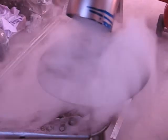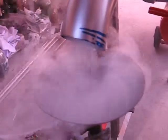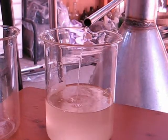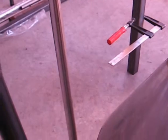Now I'll try to point out when the condensate starts to run. It's just here on that long flowing line. This is the pure essential oil flowing here after being separated. The separation process continues as the oil is made. You can see that the condensate enters the separator flask via the funnel, which goes all the way to the bottom of the separator and collects in a special cup designed to stop the oil from escaping out through the water flow pipe.